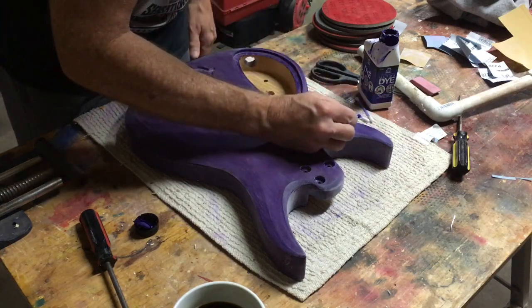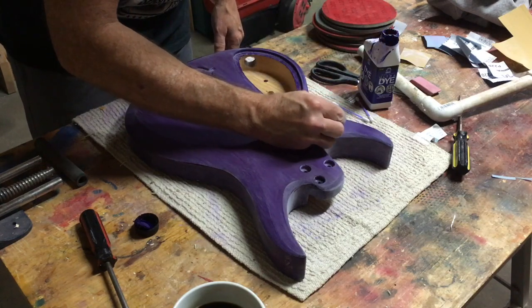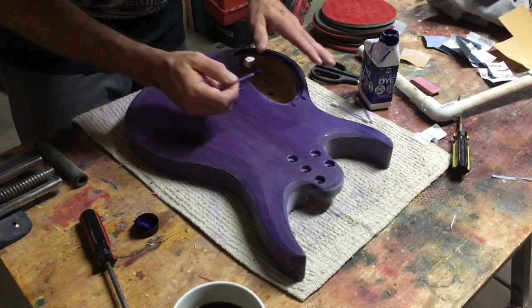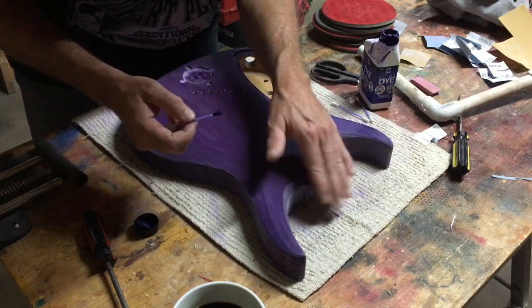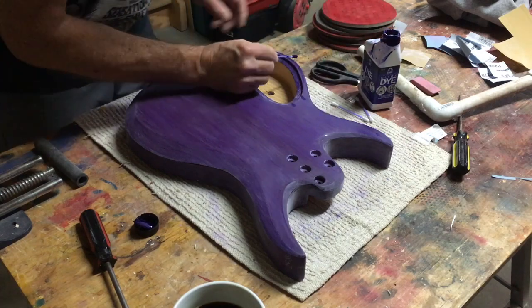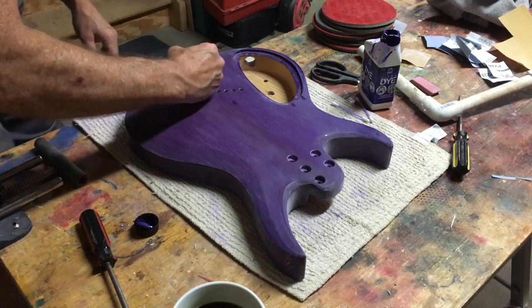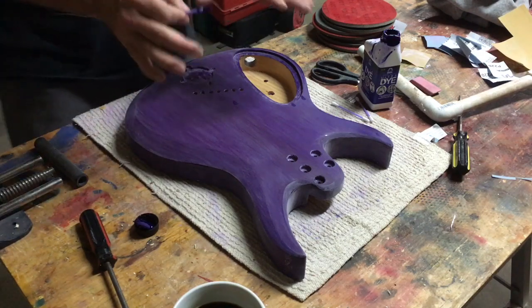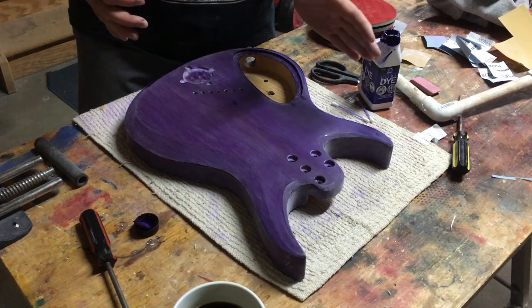As I had expected, there were a couple of spots where I actually sanded through the finish and went down into the wood. That's fairly common, especially if you've got a lot of sharp edges — and I've got a lot of angles sanded into this body, so I was kind of expecting that. All you have to do is take a Q-tip, dip it into the dye, and go back over those areas where you experienced sand-through, just go back over them with the dye and let it soak in. After it's dry, I'm going to continue applying my Crystallac Super Premium clear coats — probably another eight coats.